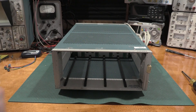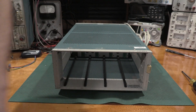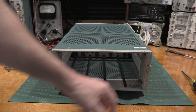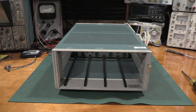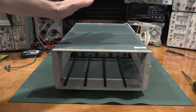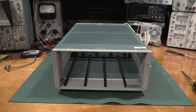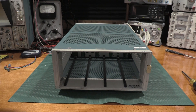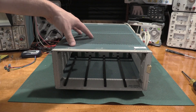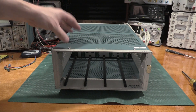This is a 4-bay powerframe from Tektronix for the TM500 series. Being that it is a 4-bay powerframe, it does have the high power compartment, so for plug-ins like my power supply, we can get full power out of them on that particular port. We're going to test the pass elements to make sure none of those are shorted, check it with the power supply, and check the ripple under load — because the other powerframe was not working well. Even though my DC load was too slow to catch it, there was a significant amount of ripple on the power lines.